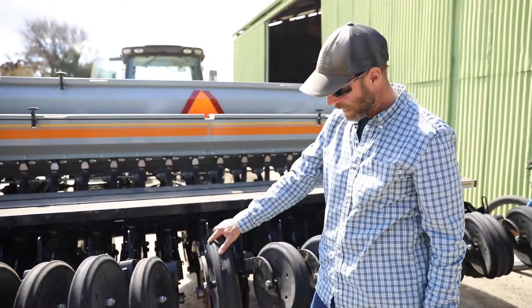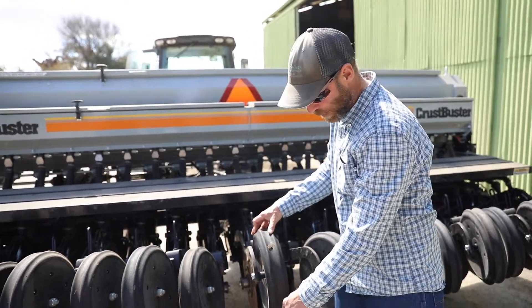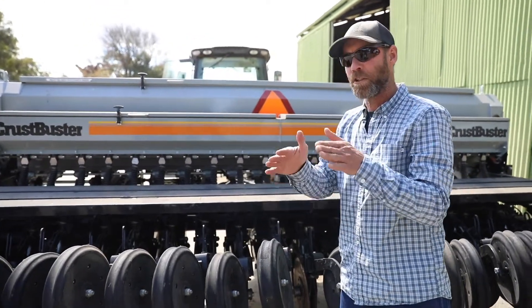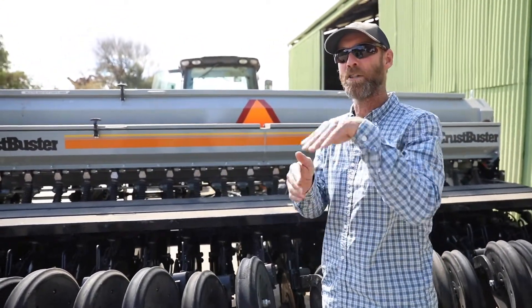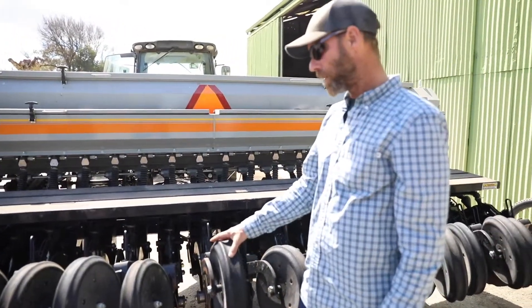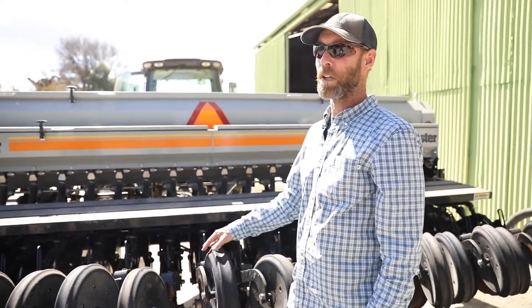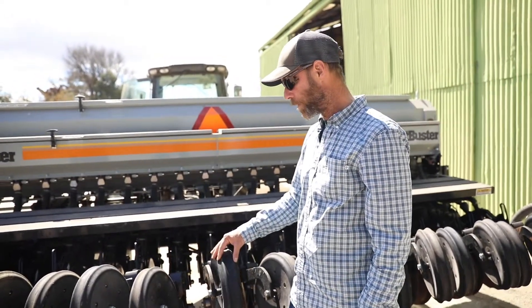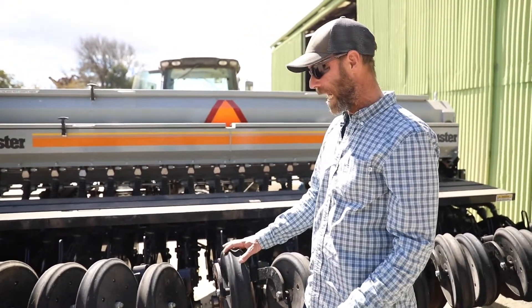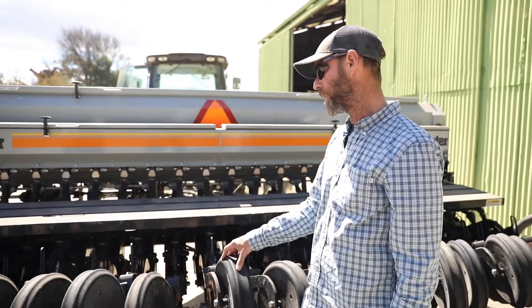The seed falls into that slot, and then the closing wheel comes along behind it and compacts both sides of the trench. If your trench is right here, it's actually straddling it and packing in from the side, so you're getting good soil-to-seed contact without compressing the top and without creating a lot of compaction. This design is critical for that. Right now in the no-till world there are so many options for wheels — a number of different designs depending on your soil type and what you're planting. After talking with the guys who built this machine, they decided this would probably be our best option, and it seems to be working well.